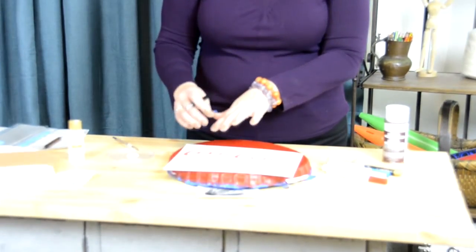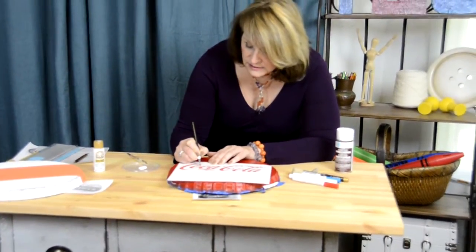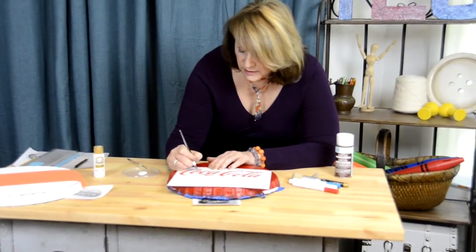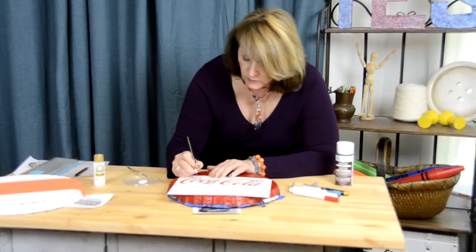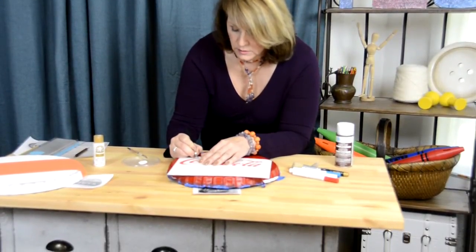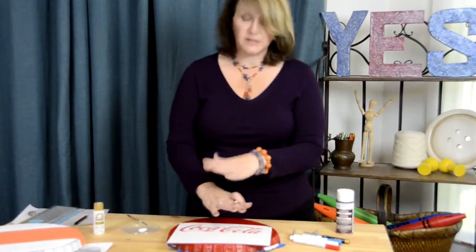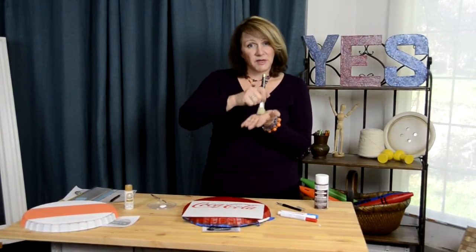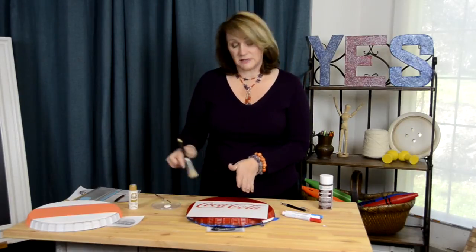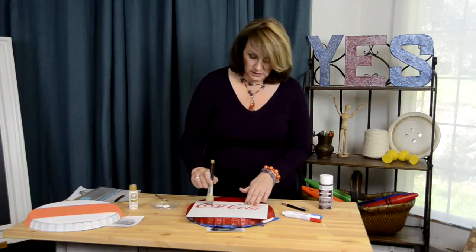I'm laying it on here and cutting it out in place, because I have pieces of my stencil that would fall away and I wouldn't have the inside of my O or some of the other smaller details if I cut it separately — I would have to find a way to add those details. So we're going to go around every single letter and remove it. Once we get all of it cut out, we're going to take a stencil brush, which is flat and allows you to pounce on it so that you're not forcing paint underneath the stencil. That's also what this adhesive helps with — you get it so there's not too much paint on your brush, and then you stencil.